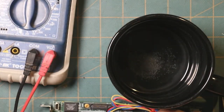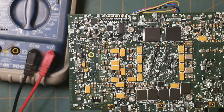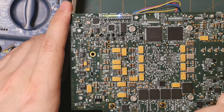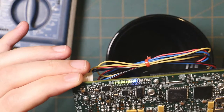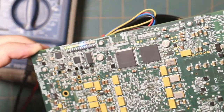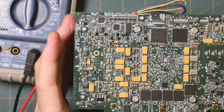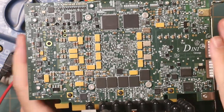I'm going to use Vivado — I've created a project. I'll power up a board with a USB cable plugged into the USB JTAG interface and see if Vivado can talk to it. I'll do auto-connect and it picked up something. We have an XCKU040. So that's the Kintex UltraScale part, and we can see the serial number: DINI 016600A. That looks like the board — it is an XCKU040, which is not the smallest Kintex UltraScale but it's on the smaller end.